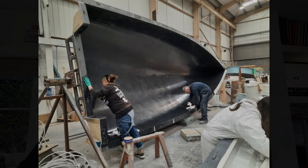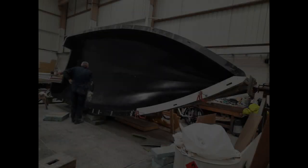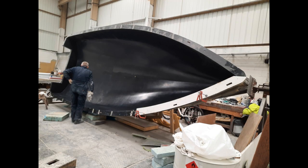Let's start with the beginning: the preparation. First of all, the mould needs to be prepared. What you see here is the mould of the BTC 22 being given a treatment so that the hull will actually release from the mould once the gel coat's been cured. Once the two gel coats have been applied, Buckley strengthen the area behind the gel coat layer with some chop strand matte, which is mixed with dry powder, in order to ensure that all of the vinyl ester resin is absorbed, making a very resin-rich layer behind the two gel coats.